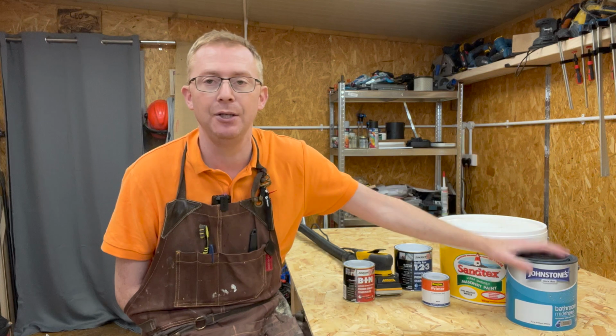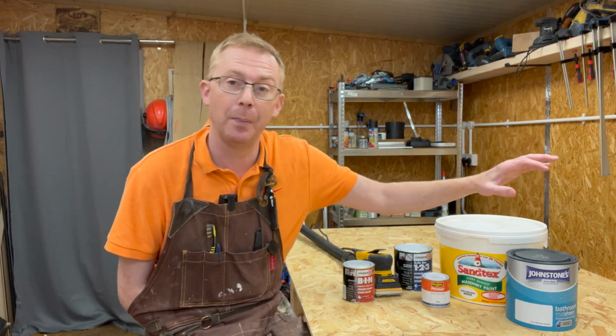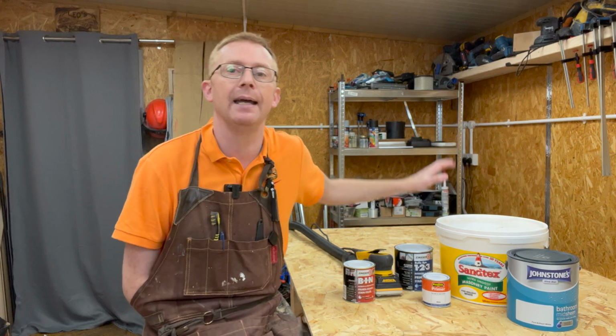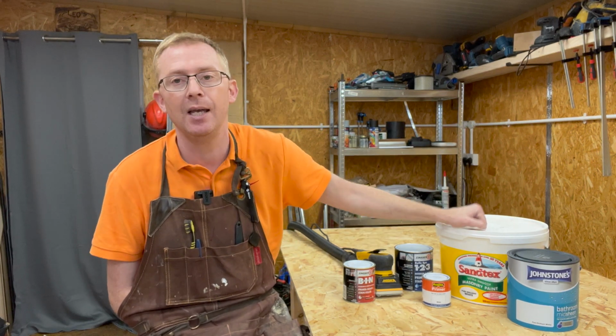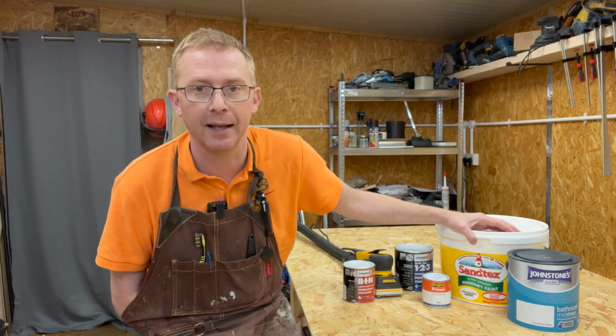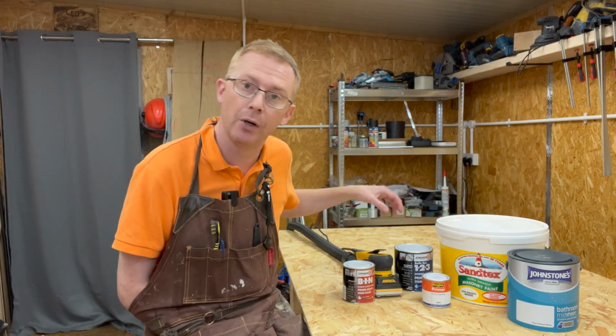So the first question that crops up, and all of this is from the comment section of my previous video, is can you just put a coat of emulsion on it and leave it at that? So let's find out. There's only one way to do it. I'm going to apply a coat of emulsion both onto an unsanded piece of OSB and a sanded piece of OSB, and the same goes for masonry paint, which cropped up. Can you just slap some masonry paint on and get away with it? So there'll be masonry paint going onto unsanded and sanded OSB.